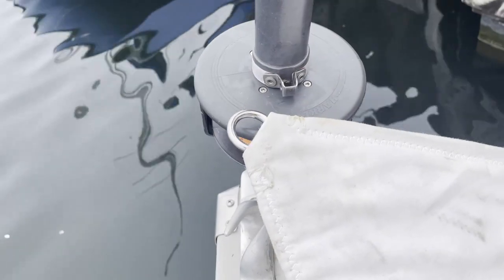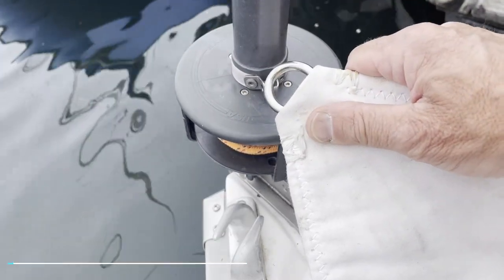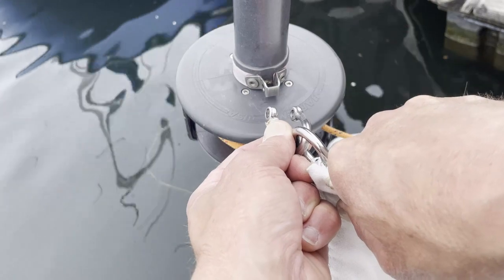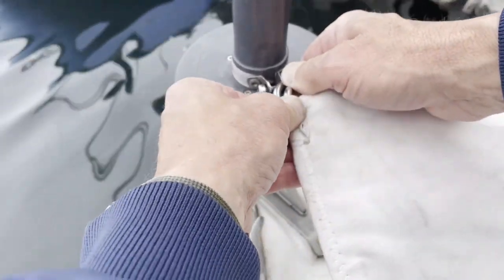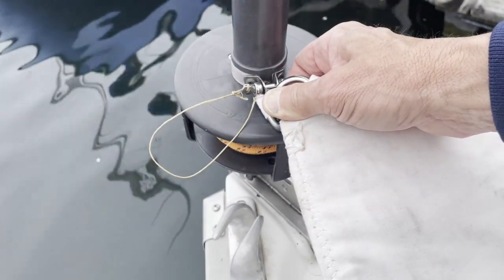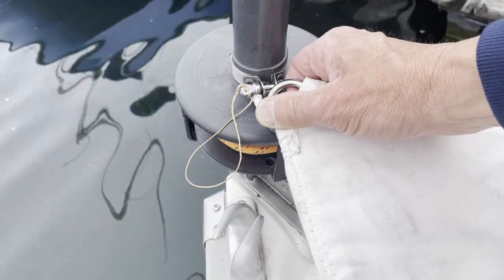I've moved up to the bow of the boat. I've got an Ensign Genoa ready to be rigged — I'm sitting on it on the bow. I've got it set up so I can place a shackle between the tack and the furling drum. The bolt rope is over on this side and this is the foot. Because this is a twisted shackle, I want to make sure that this sail will actually set in that position. So I'm going to make sure I have the string in my ring finger, place the shackle in its location, and start to twist it into place. Once it's going I can let go of the ring finger, finish rigging the shackle, bring my Leatherman forward, give it a quarter turn, and I'm done. That's the process of connecting the tack to the furling drum.